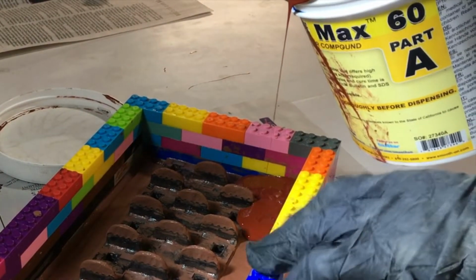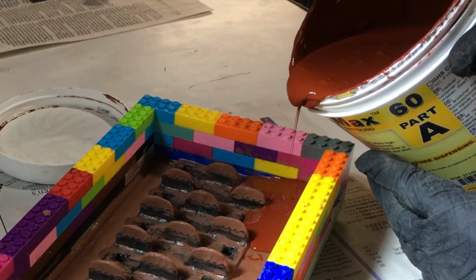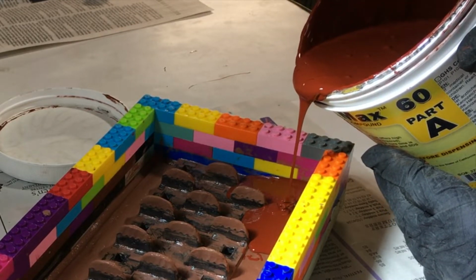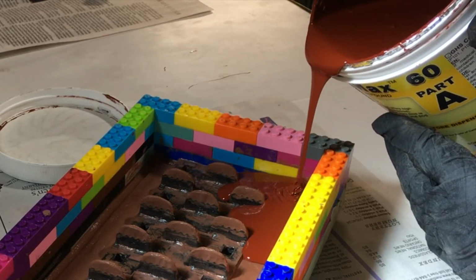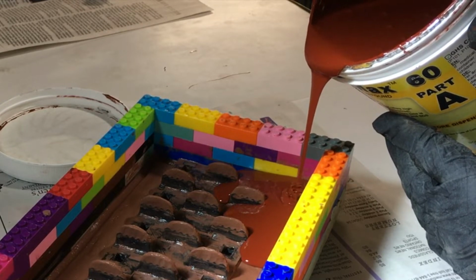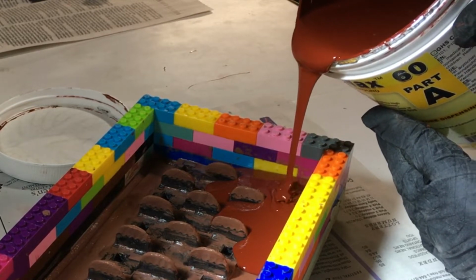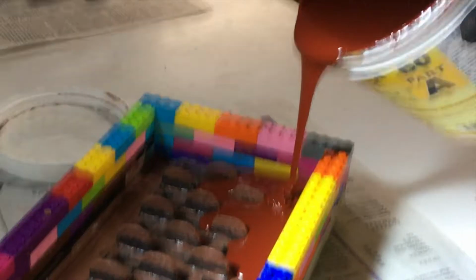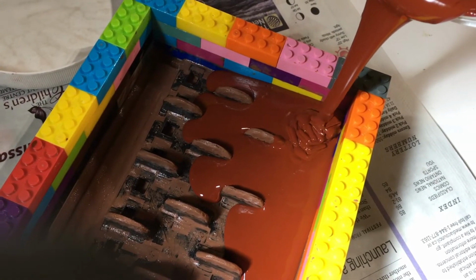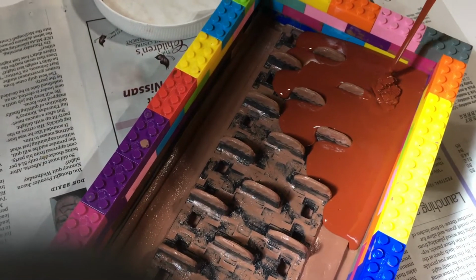So I went too fast here, so I want to wait till it goes in a crack or a hole, and we'll keep on pouring a bit. It's basically very lightly. That's how you break the bubbles. The stream is so narrow that the bubbles are just piercing as they're coming out. I can see them piercing as they're coming out. Basically, this is what it is. It's time consuming, but you know, it works. Try to get another angle for you guys. Now we'll keep on doing that all around.